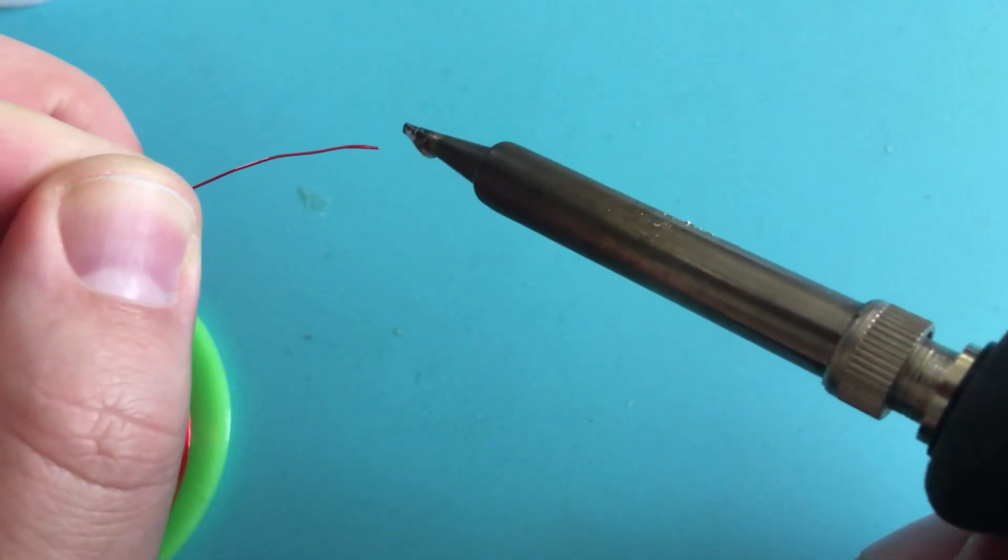I'm going to clean off my iron again and get ready for the action. And I'm going to turn my iron down to 300 degrees because I don't want to burn out my tip. There's a little bit of cruft on there depending on how you do it. If I did it in just one pass, I might not have got that, and this might even come off — or it might not. That's just melted enamel — it's there to stay. If you want to know some of the other methods, I've got a video that I'll link to in the description below — the three ways to tin. I talk about using the exacto knife and sandpaper and all that.